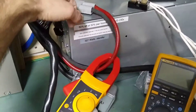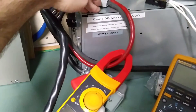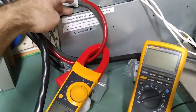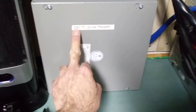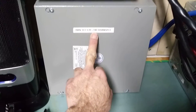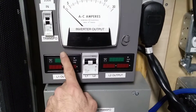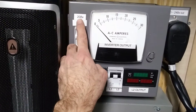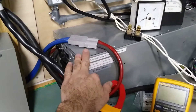The UPS outputs 208 volts, which is not very useful in residential settings. So what I did is build a transformer that converts the 208 volts to 120/240 volt split phase. I also have this panel here to monitor everything — Line 1 and Line 2 with circuit breakers — so we can see the power produced on each line, plus the circuit breaker for the 208-volt input and the amp draw from the transformer.